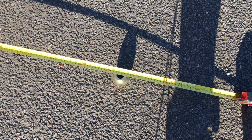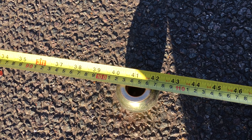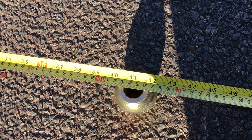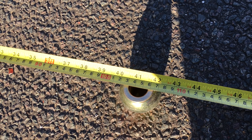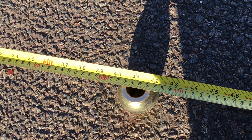Now we're looking at the measurement. On this occasion, with an accurate signal, the tractor is actually at 103 centimetres. I'd expect that to be a metre, so we now have to go into the tractor and alter the figures to compensate for that.